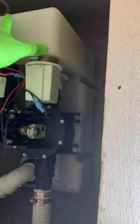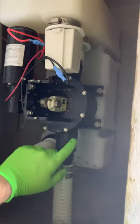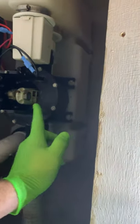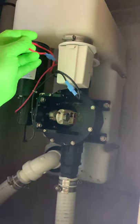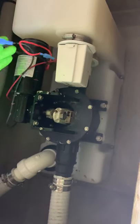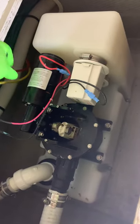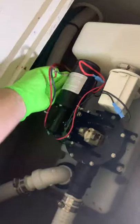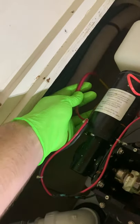So this is the actual vacuum tank here. This is the vacuum switch. This is the pump; these are the sides of the pump. This is actually where the duck bills are located. This is the bellows. This is the motor. As you can see, this power wire comes out of the vacuum switch and the ground actually connects to your main wires. Most post-boat construction you're going to have yellow ground and red positive for your 12-volt system.